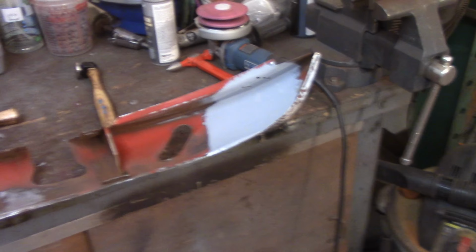All right, so it worked pretty well for bringing these high spots down, but unfortunately, that's still a pretty good low. So, nothing we haven't done. So I'm just going to, again, in this particular instance, just pick up with a dolly on that low spot, hammer it around.